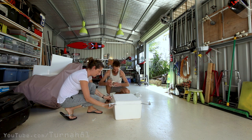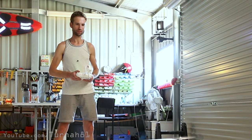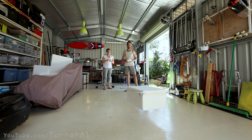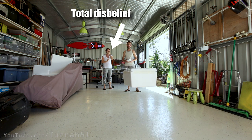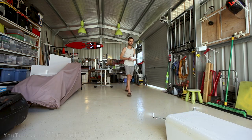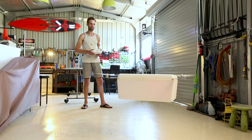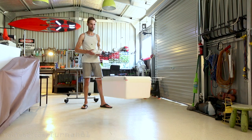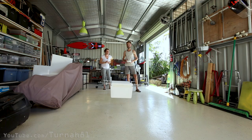With the lid just taped onto the bottom part of the box, I gave it its first flight in the shed. You can see when I'm first flying I've got my hyper-focus face on. It didn't fly too bad — it hovered, took off, and it's quite messy near the ground because of all the turbulence from the props. The higher I got up in the shed the more stable it would be. The only problem was when I'd go to rotate, I'd go completely the opposite way. It turned out the anhedral/dihedral angle wasn't quite right, so I just chopped it up a bit more and bent everything into shape, and then it flew pretty well in the shed.